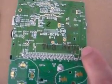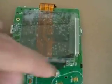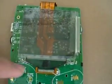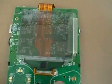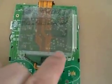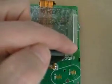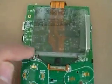Either one of these VDD points is fine. I've been using this point right here because the wire comes from behind the screen — it'll come from behind the screen kind of up here. Instead of hooking down, it'll interfere with the buttons down there, so I've just been soldering kind of behind the screen to this VDD point.